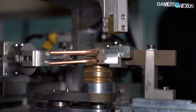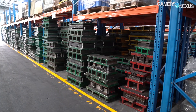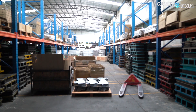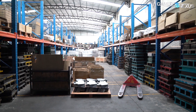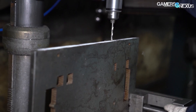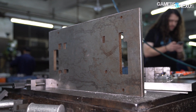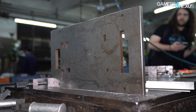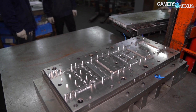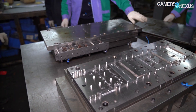Let's start our journey with the aluminum fin stack tooling. Before the fin stack itself can be made, a tool for the fin stack has to be created. Cooler Master has shelves upon shelves of tools, some dating back to about 2003 or 2004, with some of these tools costing upwards of a million dollars for a single case. Each tool is good for a product lifecycle without meaningful degradation of the material. Tools are made by skilled machine operators and technicians who use large drills to bore holes into metal slabs, and machinery is also used to cut holes where the stamp needs to impact the sheet metal. Tooling can take up to 60 days to complete depending on complexity and how many revisions are required.